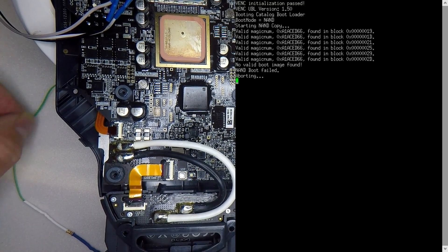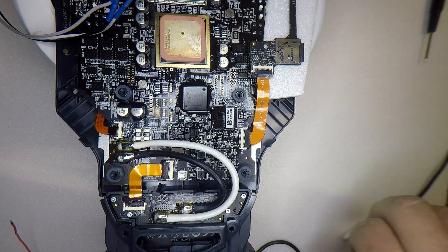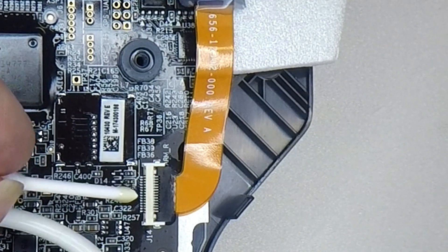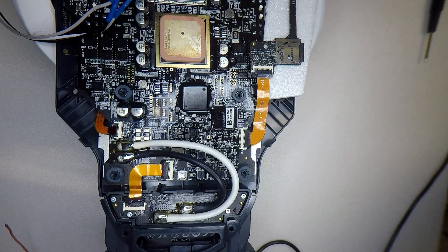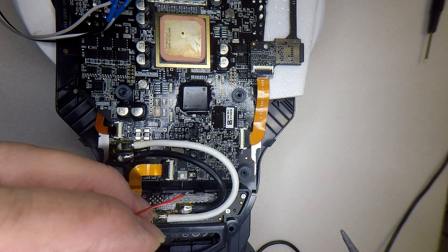Let's pull the battery out. I'm going to tag in on the FB-36, but I need to draw power from somewhere else. I'll go up to the JTAG pin. I'm just going to put a little bit of flux on both those spots because it helps with the soldering process — it helps heat distribute around, which means you don't need to apply as much heat to get the same effect.